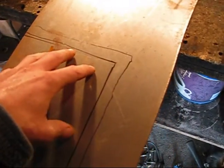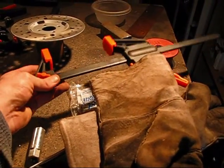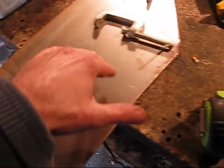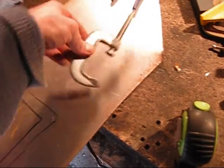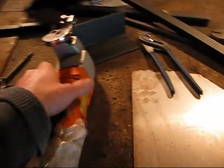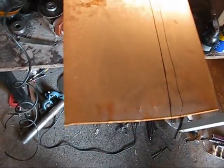I'm going to be working on the back plate that I'm going to put on the back of the seat and the seat pads. When it comes to cutting sheet metal, you want to make sure your sheet metal is bracketed down nice and solid, so I'd suggest using these kind of clamps. I'm going to use my Harbor Freight cutting shears and cut out this section here, which is about a half inch or so smaller than what the pad is.